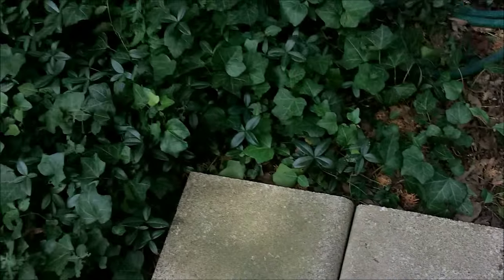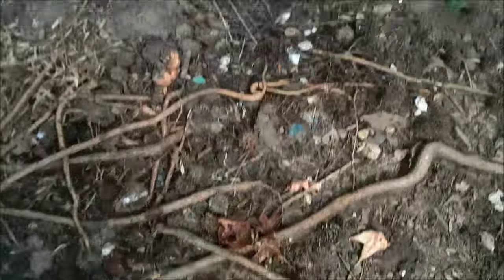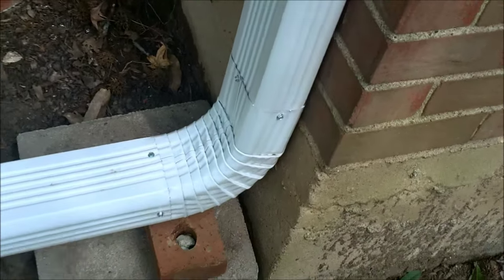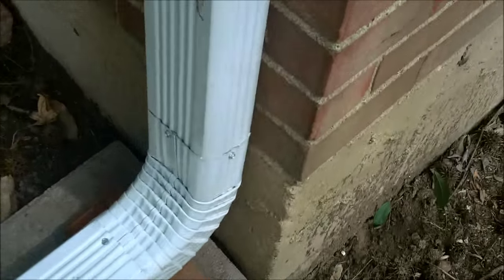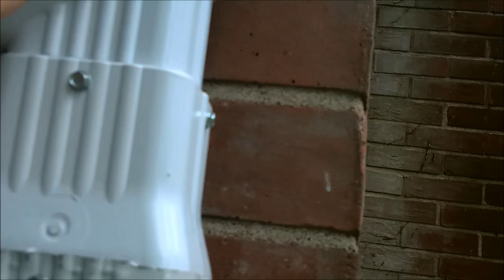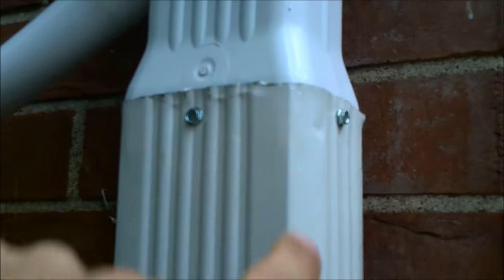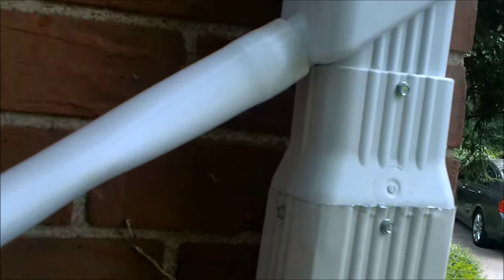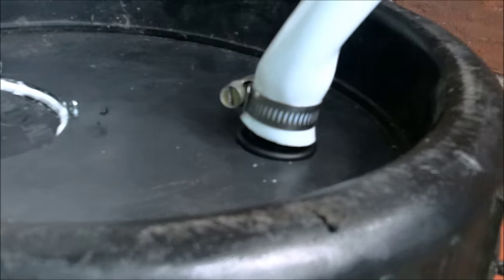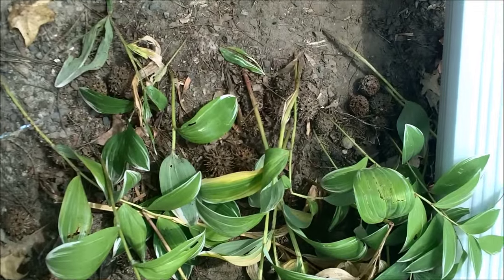Here's the end product. The water is running away from the house — a long way away from the house, luckily. It's got a little bit of slope on it right there. You've got all the drainage issues right here where all the erosion took place; we're going to backfill that later. We need a 90-degree fitting that goes the other direction, but I don't want to go to the hardware store right now. Up here, just as I promised, I put the outflow for the Odie system — actually the inflow — and just screwed the plastic to the plastic and shoved it into a 3x4. That line comes down and fills up the rain barrel. I got a hose clamp on the ill-fitting bulkhead barb, and you've got your access there — we've got to keep it closed otherwise it drains continuously while raining. And here are all the plants that I killed in the process. Sorry, sweetie.